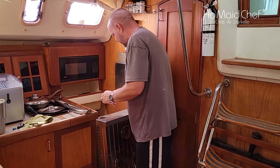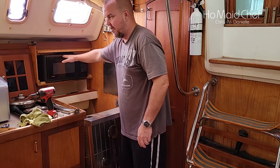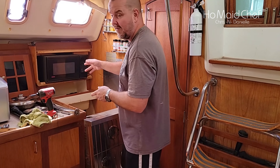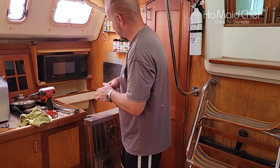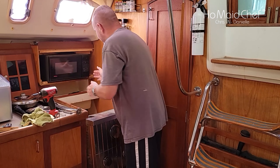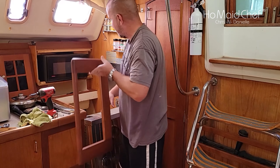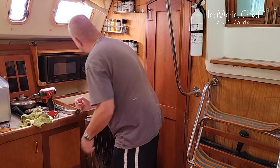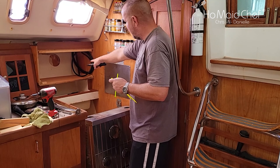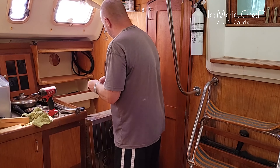This is just all kinds of nasty back here. I found a separate circuit I can run — this works because the microwave runs on its own breaker and we can only use one at a time. So I'm going to run off the microwave breaker for the stovetop, and the wiring just comes right up through here. I just took this face plate off — just four screws and it comes right off. The microwave is out and I pulled the gas hose back up through here. I'm going to leave it behind this cover beside the microwave since there's no gas in it.